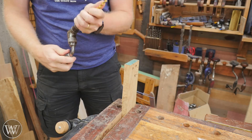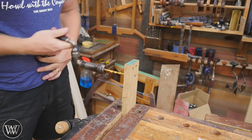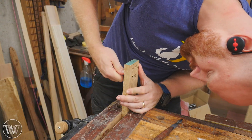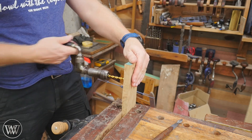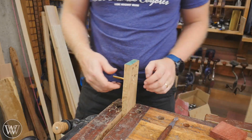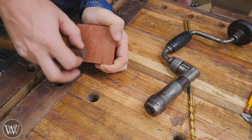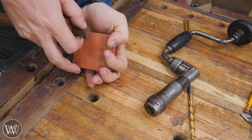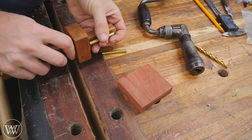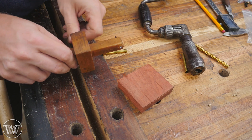Let's make ourselves a pin. First thing I want to do is actually test to make sure that the hole for the brass shaft is the right size. I have several bits that are close to it. One of these days I should go out and buy the actual approved bit that is a specific size, but I find just testing it and getting it close gets me basically what I need. This one is close enough that if I lather it up with a good bit of gel CA, it works really well.